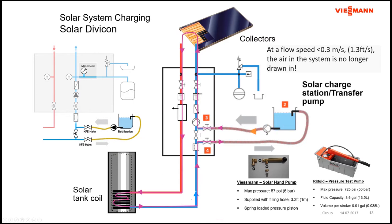As we fill the system and get that fluid flowing back nicely and clearly, we can start to throttle back the return valve. Throttling it back increases the pressure on the system and we want to fill up to our fill pressure. I'd recommend adding another four or five pounds above the target fill pressure — that reserve allows you to continually purge air out of the system. Eventually you'll be able to drop it down to your final fill pressure once the air has been eliminated over time.